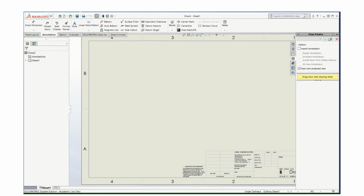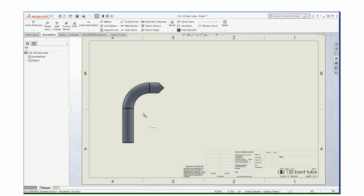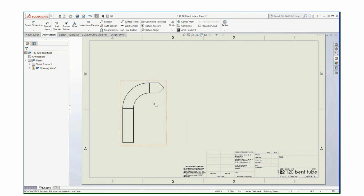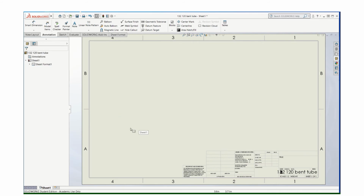Okay, so let's find our piece of tubing there. And we're looking for the front view. Most information, fewest hidden lines, longest dimension. And I don't really see what I want. You could use this. It's okay. A better way to do that, again, if you think about our paper is longer this way, the better way to do it is to put the longest length this way.